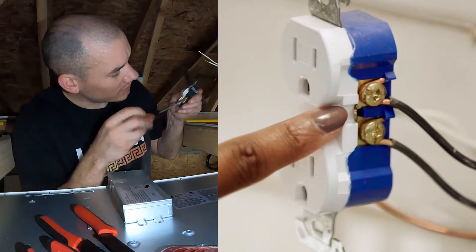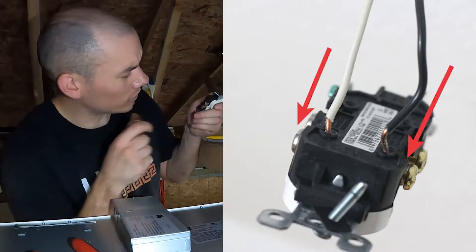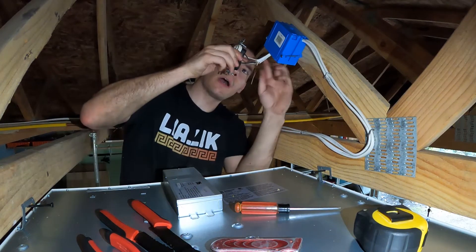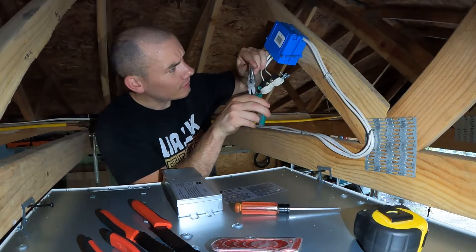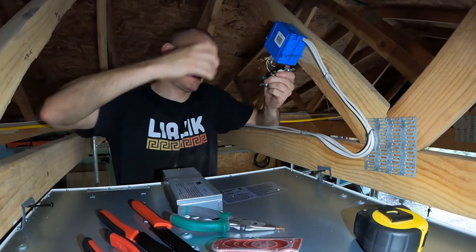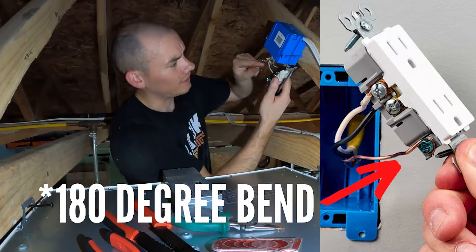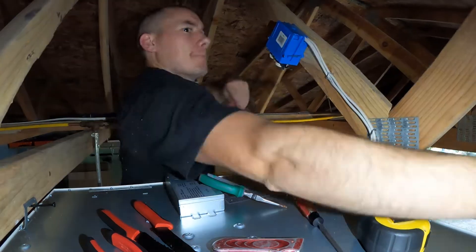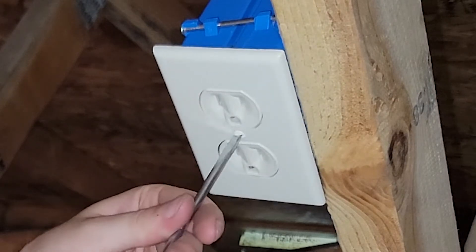Then I grab my outlet, and you have the option to put the wires on the side. I like to put them straight into the back after stripping them — you just push them right in those holes. I prefer that method. Black wires go on the right with the gold screws. Push it in there. White wires are in, black wires are in — that's tight. Now the grounds. I take my needle nose pliers and do this maneuver here. Bend it over, bend it over. Then you take that 90-degree bend you made and loop it around that green ground screw. All those connections have been made. Push the wires in, line up the screws, then take the cover and screw that on there.